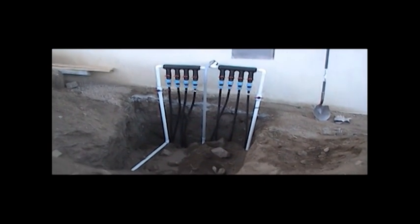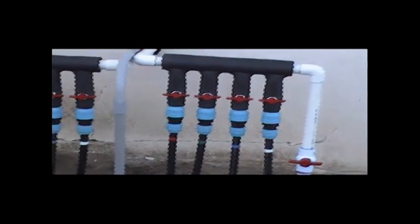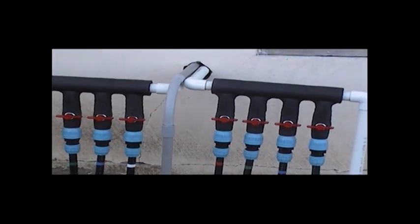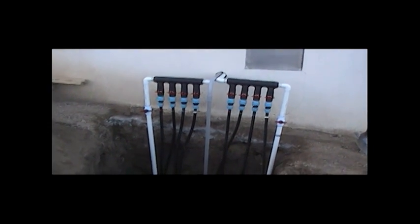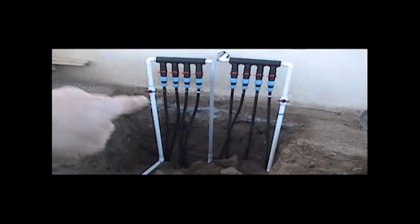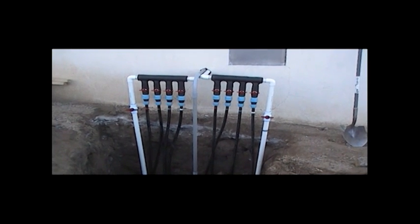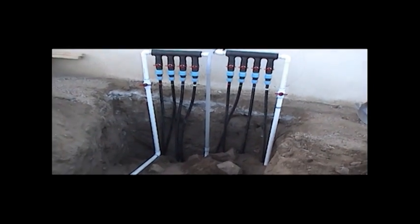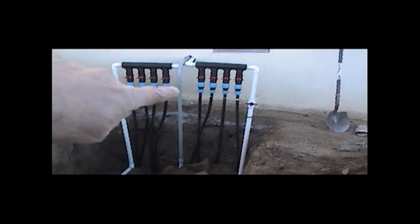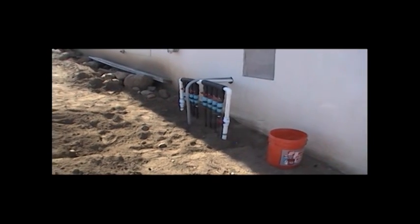Here's the final product that same Sunday afternoon. Here are the manifolds — one will be intake and one will be outflow, which I'll work out with my HVAC contractor. These parts coming up on this side are planned for possible future use of the same geothermal heat source to run a small spa heater. I'm not going to put that in right now, but I put in the plumbing to the future spa location while I was at it. This conduit will run electricity out to where we'll put all the spa equipment. You can see where the pipes go into the crawl space — now we're shifting all activity there.